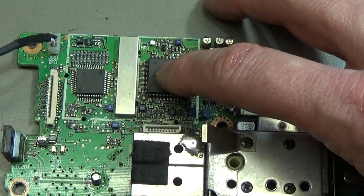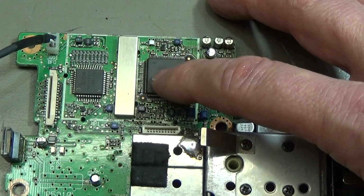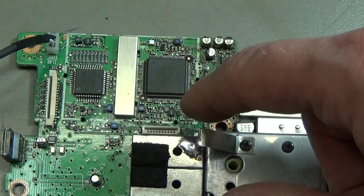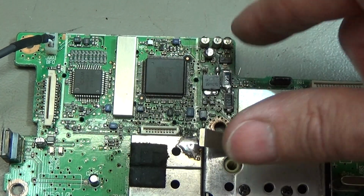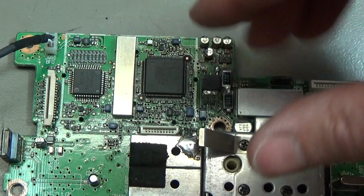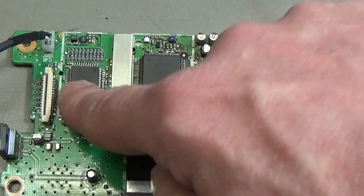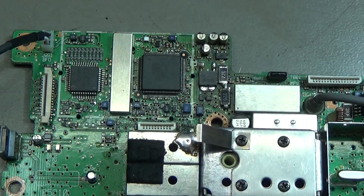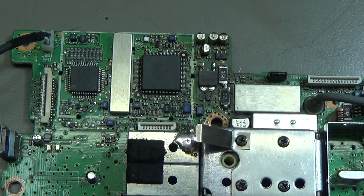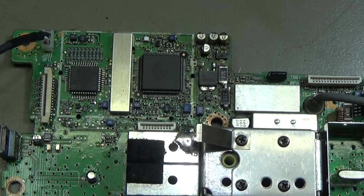So that means something must have happened to this IC as well. It is difficult to say if it is working. I mean, we didn't see the DDS output here, so that was what we have seen. That could be the reason: this IC is dead, and we have an unlock condition to the MCU, and as I said right at the beginning, the MCU is then shutting down different operations.